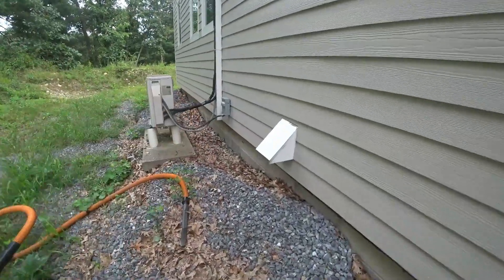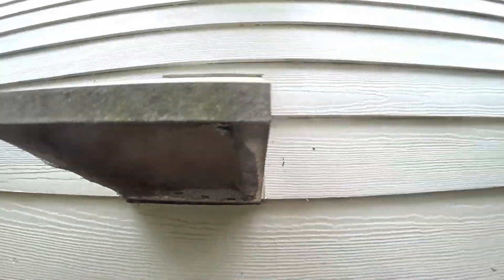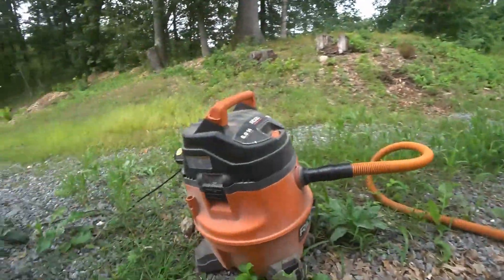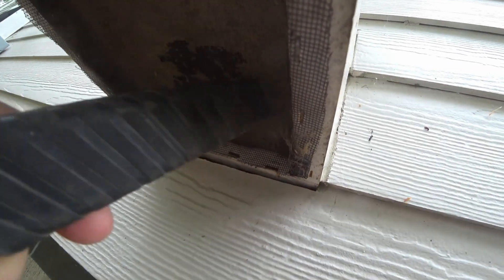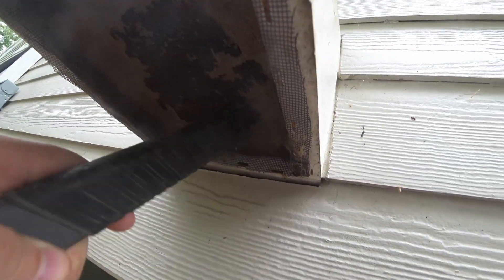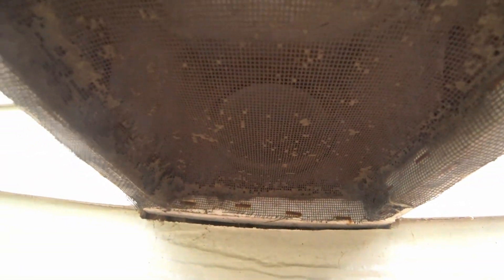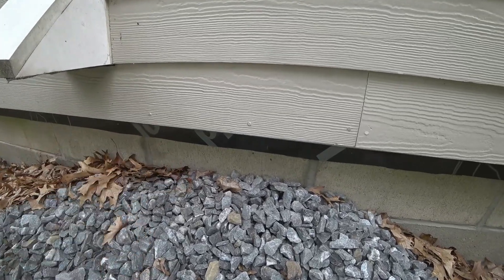This other hood is the intake and this one collects dust — you can see right here, we can't even see up through it. So we're going to just turn on the shop vac. Now that's clean, and you can see inside we have another four-inch pipe that goes in. We're going to head into the crawl space and clean the HRV unit itself.